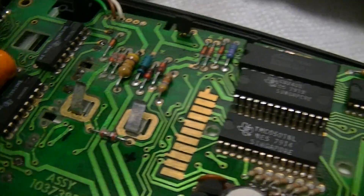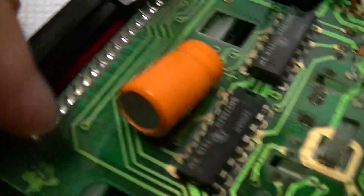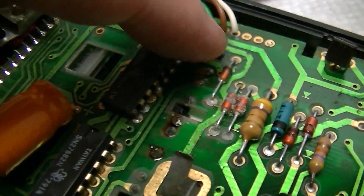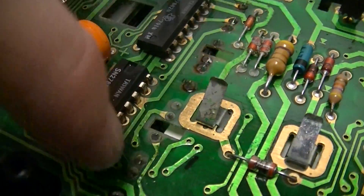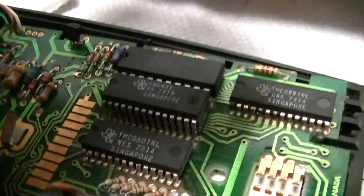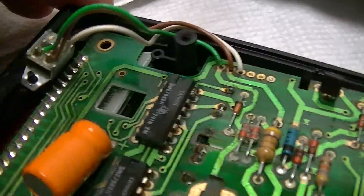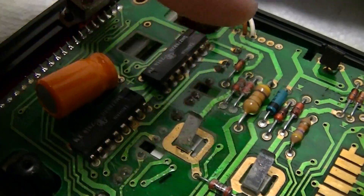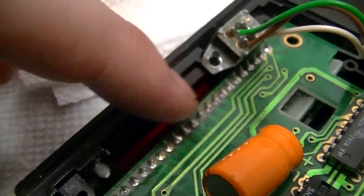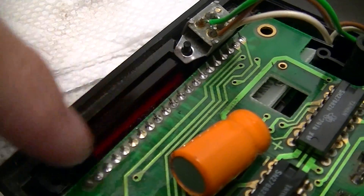There's just little bits of solder flux shmoo around these because these are obviously soldered in after this board is placed on top, otherwise fully populated and stuck on top of the keyboard module — just 14 pins, which is what you would expect from a 45-button key matrix, and then there's just the connections for the LEDs there.